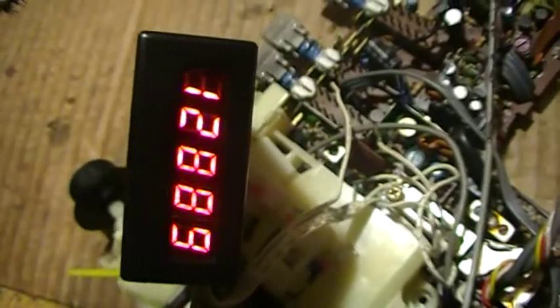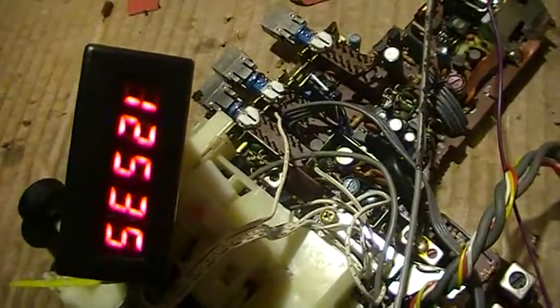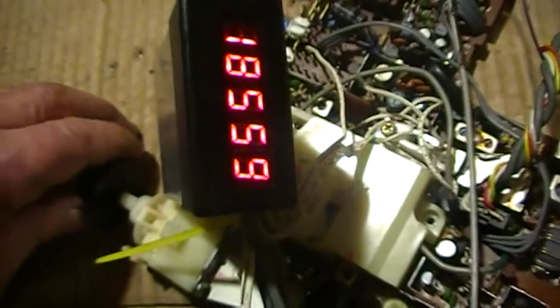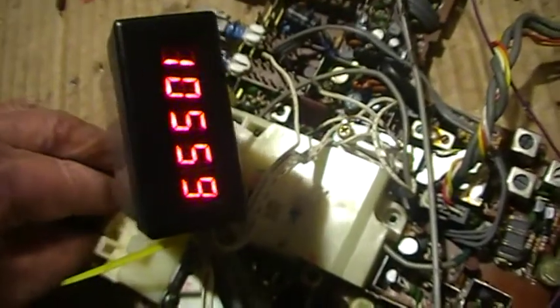So that's basically what I've done here. I've checked pretty much everything as I've gone. I pulled it out of its chassis - I just got sick and tired of fighting with the damn thing in the end. As you can see, the synthesizer's locking up beautifully. It's fully tunable. That's the kilohertz tuning. We've got one megahertz steps here - fifteen, sixteen point five, seventeen, eighteen point five. That's the one megahertz steps. We've then got decade steps.